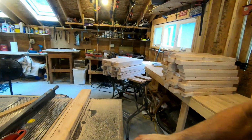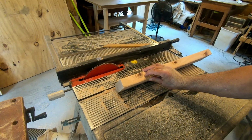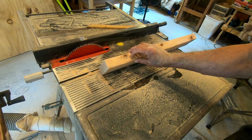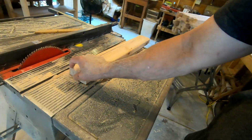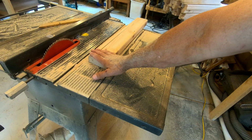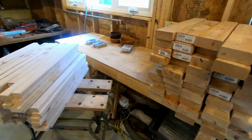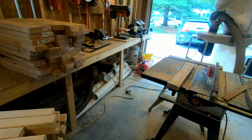And rather than just trying to split them this way, which would be less than 3/4 of an inch, which is less space than is optimal, I'm just getting 4 out of each rip, which is a little more than is usually needed. People say 1 inch, but 1.5, and it's absolutely consistent, which is important for leveling each layer. But boy, hope my math was right, because this is a boatload of ripping.